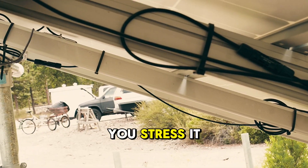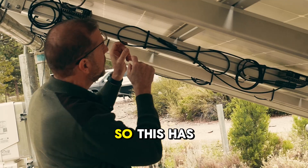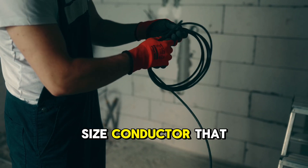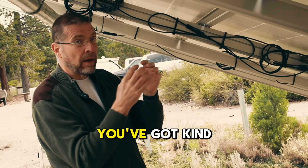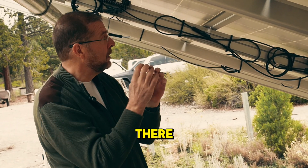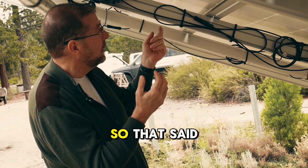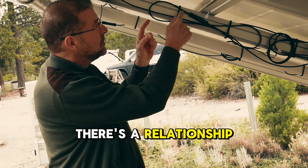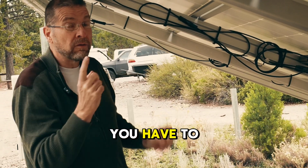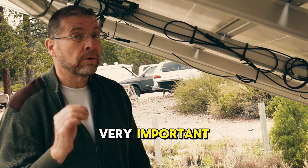This is probably about the most you'd want. If you bend a cable too much you stress it — you can actually do damage to the insulation and the conductor inside. This has a heavier insulation than a regular-size conductor you'd buy at Home Depot or Lowe's, so you've got a double-thick insulated wall for extra protection, because these things can run up to 600 volts. There's a relationship between the diameter of the conductor and how tight you can bend it — you must stay within the permissible bend radius when doing your cable management. Very important.